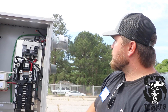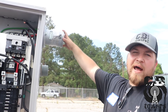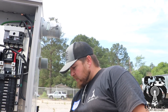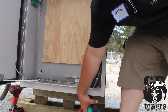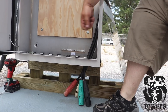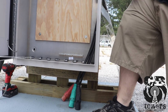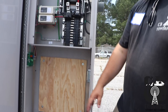Just in case you come across a site that doesn't have the cam box, you might have this one — it's called Appleton. Half the time we're not supplied with an Appleton, so that's where hardwiring comes into play. Most of the time you'll be provided with these pigtails. You'd look for a two-inch knockout and knock it out with a hammer or screwdriver; if not, use a two-inch hole saw. Drill your hole toward the bottom, not the sides — that way no rain will leak in.